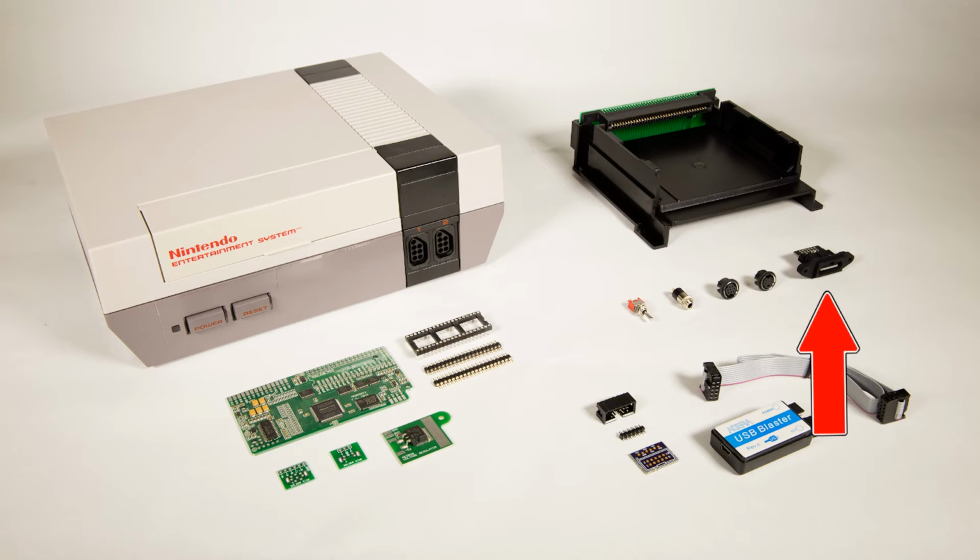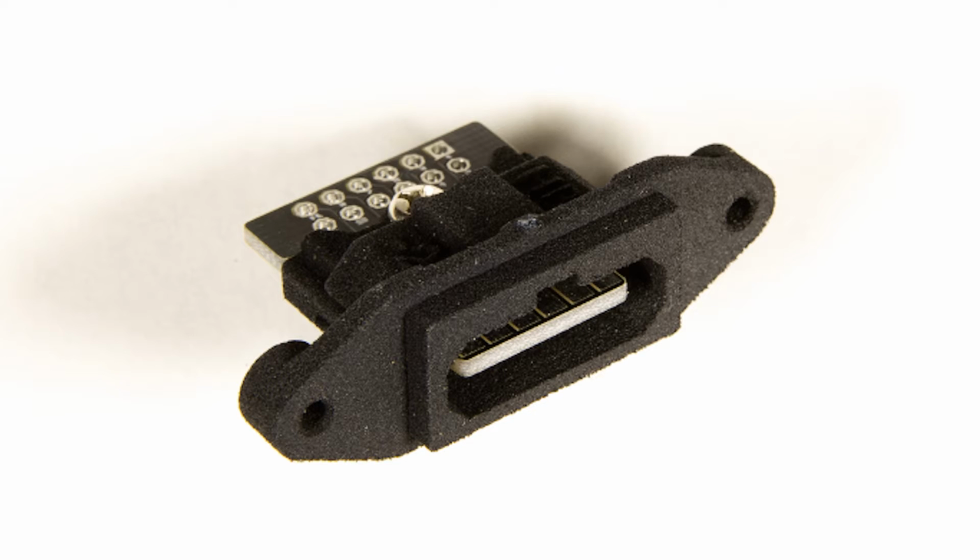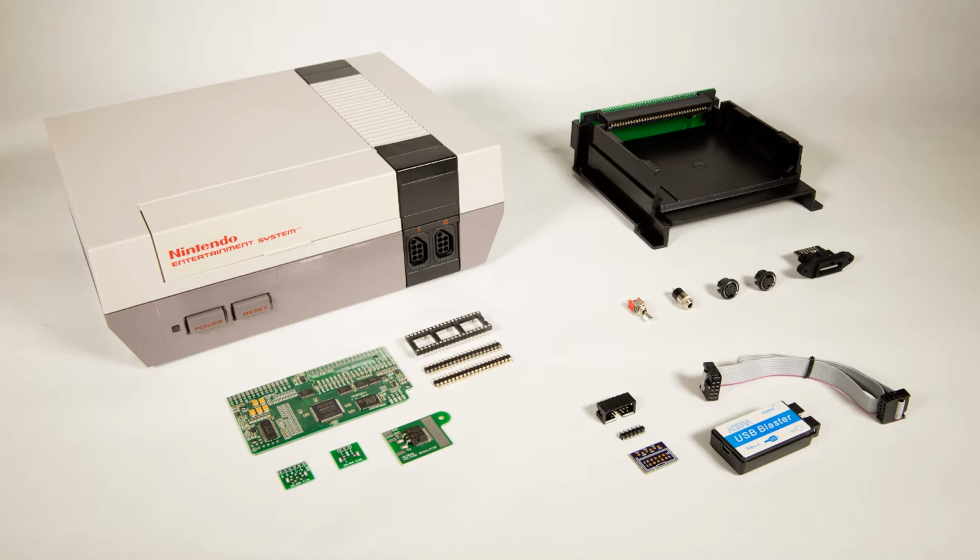That's where the multi-out connector we talked about earlier comes in. I did some research and discovered that Buffalo Wing and Helder of assemblergames.com had actually designed and 3D printed some multi-out connectors. Here's a closer look at their design. Their multi-out connector simplifies things a lot, because I won't be needing the 3 connectors provided with the kit, and I won't be needing the boards for those connectors either. Just one multi-out port that carries everything.